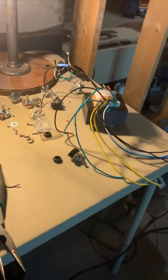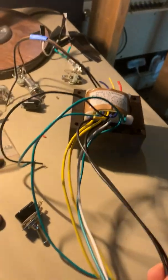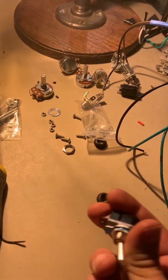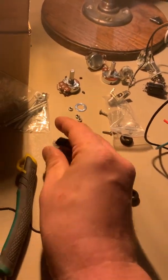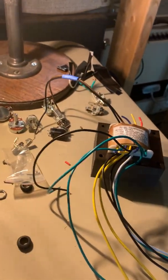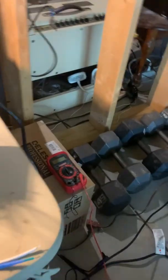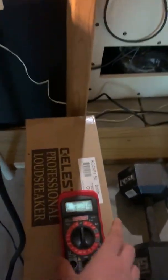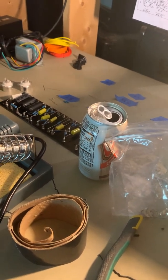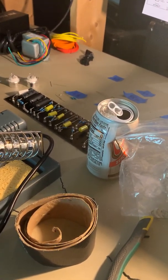When I tested the voltages, I didn't put the center taps to ground at first, so I was getting very odd readings. I actually wrote to the seller saying that the power transformer was bad, so I'm going to have to write back saying that it's good. It is wimpy, but we are going to see what it sounds like. I've got this $65 Rocket 50 Celestion speaker, and I'm going to build a cheap cabinet — not going for looks at all, just going to throw it together. Chinese kit.